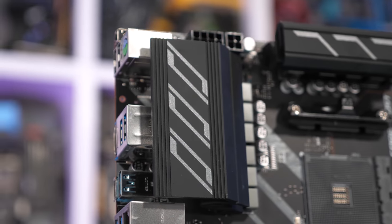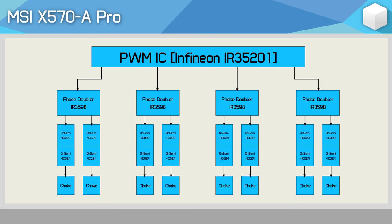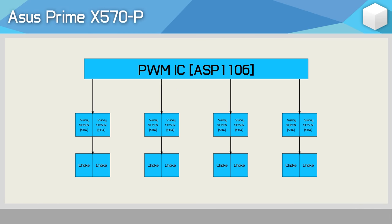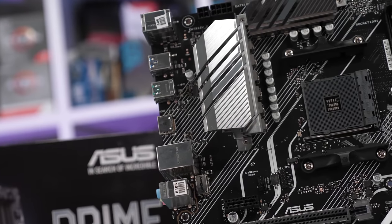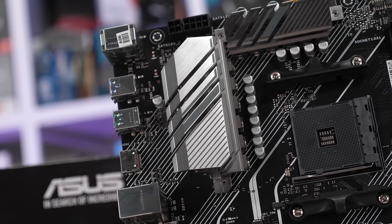The boards are tested in an air-conditioned room maintained at 21 degrees, so the results can be much more favourable than what you might find in a poorly ventilated case, or even a well-ventilated case in a much hotter environment. Also, if you're buying a motherboard for any amount of money, you want to know if you're getting the best quality product available. In the case of the MSI X570-A Pro and ASUS Prime X570-P, both boards cost basically the same amount and offer similar features, but one was worlds better in terms of VRM performance — and that's not something you can upgrade. You can't simply upgrade the VRM, so you're stuck with whatever you get.